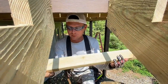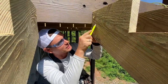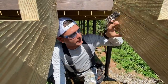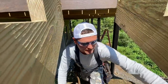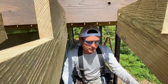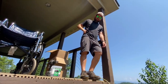I'm under the steps installing a board I call the hanger board. It gets mounted to the back of the vertical cuts. Because of the way the board is cut, there's a grain line running here and it could snap pretty easily — the notch in the tread runs right there, so the whole heel of the stringer needs to be supported to carry the load on the steps. This board mounts from the back, and then pieces of blocking overlap through the band and through the hanger to support the whole top end.